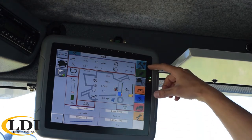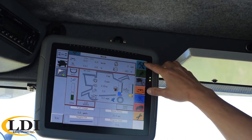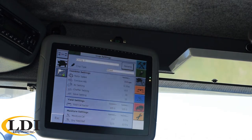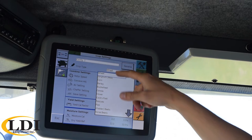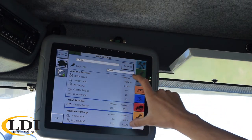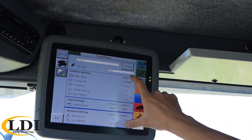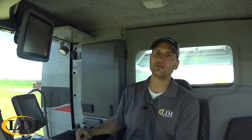On your right side here you have a couple different windows you can go to. The hammer and the shovel on the top right would be your main work screen. If you go down below that, it takes you to your crop settings. Within here we're already selected on wheat. That's going to pull up your different crop settings. Now it won't automatically change the machine to those, but it's basically a quick lookup table for those settings. What it will also do with that configuration is reload any calibrations you've saved for your yield and moisture, so you're closer when you get started.